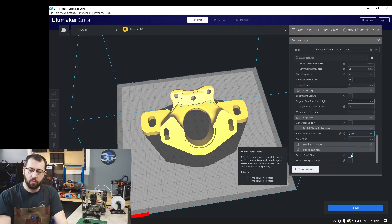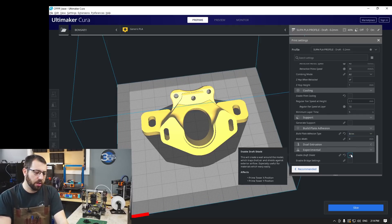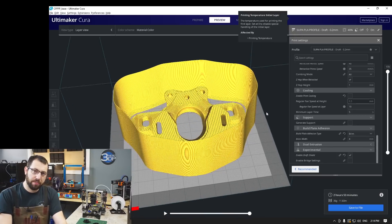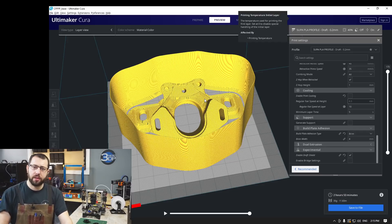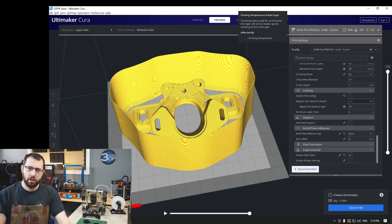And lastly, for major settings that can help with printing ABS in your slicer, is a draft shield. This can be used to keep the heat in and prevent drafts as you're printing. Draft shields are really only beneficial when you're printing open air. So if you're unable to enclose your printer for whatever reason, you can print with the draft shield. This does lead to more successful prints when printing ABS unenclosed. You're not going to get the same level of layer adhesion with higher ambient temps as a fully enclosed printer, but for smaller parts, this can help give you successful ABS prints at least to get you going.